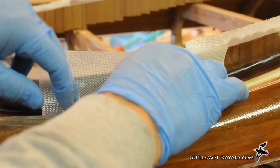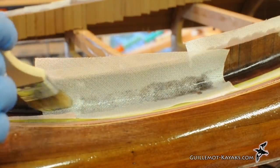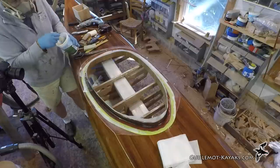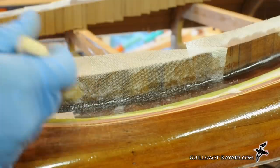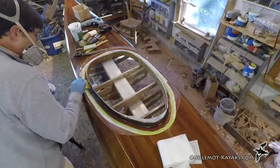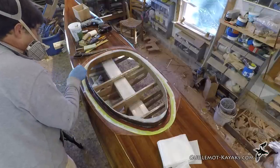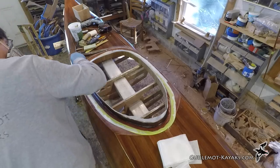It takes several lengths of cloth to get all the way around. At the end I need a patch for the last bit. I overlap each end a couple of centimeters or about an inch. Since I completely wet out the fiberglass using a brush, the fabric soaks up more resin than it really needs. I lightly squeegee the cloth to scrape out the excess epoxy and slide the squeegee through the slot in my paper cup to clean the edge.